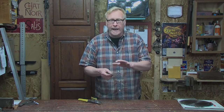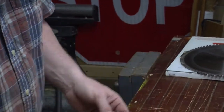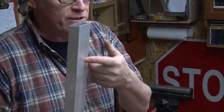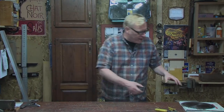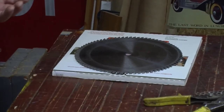That looks great — I cut them oversize. These edges are sharp, so I'm going to take a file and smooth those down so it fits in nicely to that top rabbet. Now we have to cut our aluminum channel to three inches as well — this is a three-inch wide channel that I ordered. I'm going to cut it to three inches long and then clean that up. The edges will be sharp so we'll clean those up so it fits in the rabbeted base. I have a triple-grind saw blade here just for aluminum — it's great for cutting non-ferrous metals. You can use a regular saw blade but the aluminum heats up and can gum up the blade.